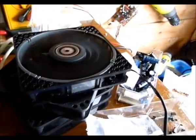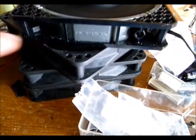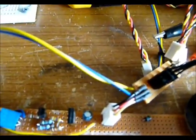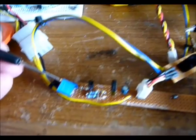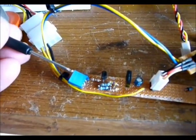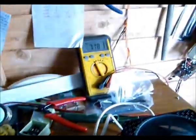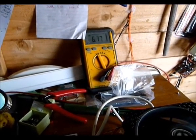Now with one fan - a 0.1 amp fan, pretty typical of 1500 RPM fans of this caliber. At the moment it's showing 10 volts because I haven't adjusted it yet. This may be on the lower end of the scale for this particular 5k potentiometer. I'll dial it down and see where we get to - it's a 25-turn potentiometer so it could take a while.